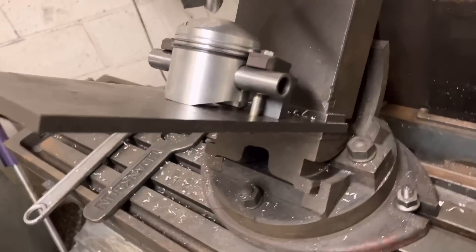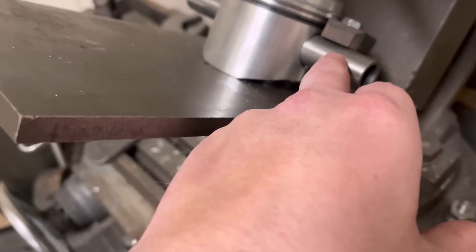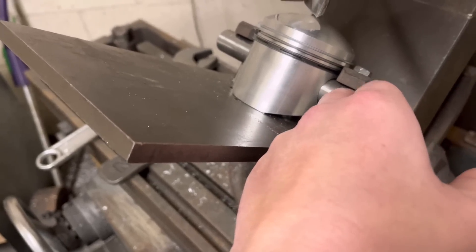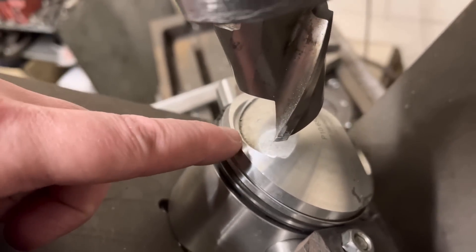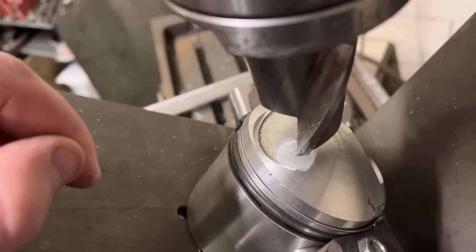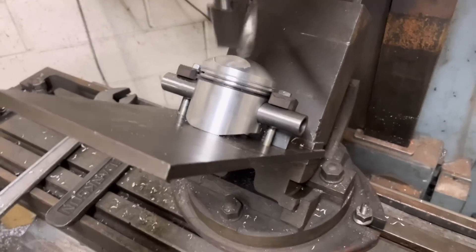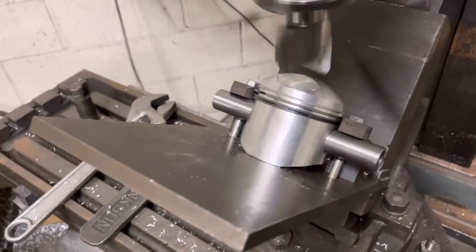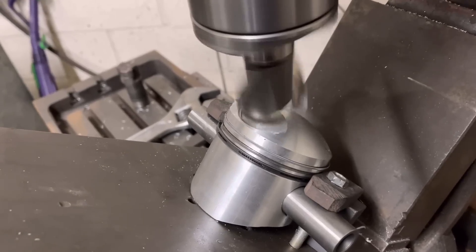As you can see, we're set up here in a similar way to how we do the Cosworth ones, although we're using the existing pins and just clamping them down either side. You can see I've almost finished that pocket, but we're just easing them out about a millimeter all the way around. So what we do, fire up the machine, and we just ease this down very, very slowly.